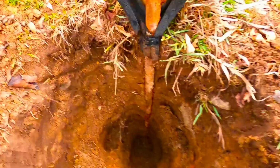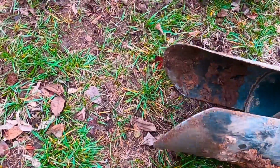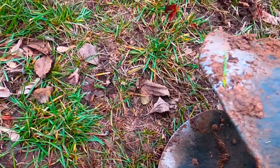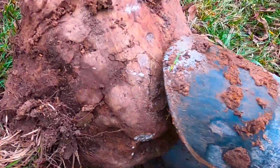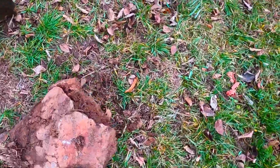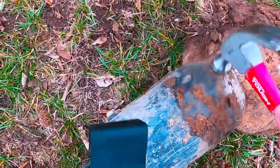So first thing we got to get done is our post hole digger that we're using to pull dirt up out of the hole has a bent blade on it. It's not bad, but I'm going to show you how to fix that real quick. Fairly simple. You just find where your bend's at, get yourself a rock, tuck it up next to that with your hammer, and just line that up as best you can and just hammer that out of there